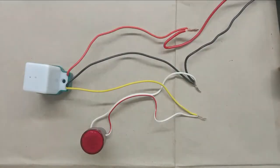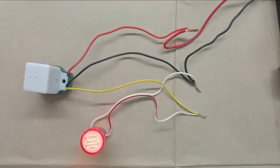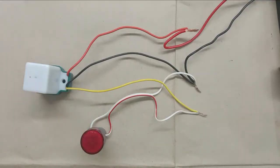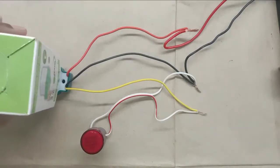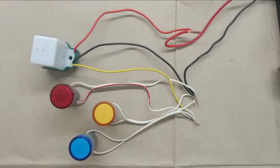I have done the connection of the sensor with the power source. Right now you can see the indication lamp is not glowing because light is falling on this sensor. Let me take this sensor away from the light — I am hiding it. Now you can see the indication lamp has started glowing. On removing the cover, after a few seconds the indication lamp will turn off automatically. Here we are not using any switch; everything is automatic. Our sensor is turning on and off this lamp. If you have more lights, you can connect them in parallel and operate them as well.